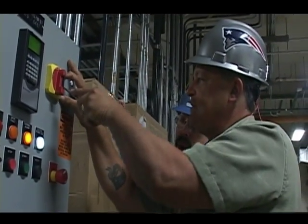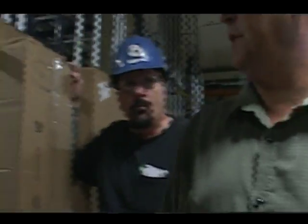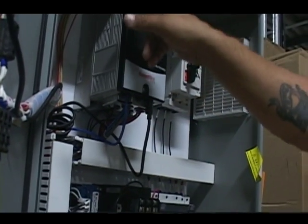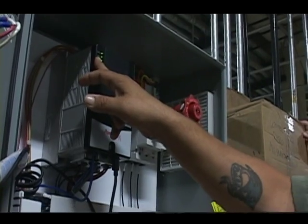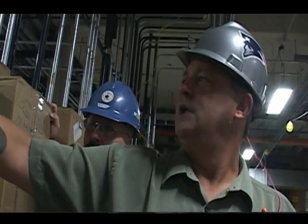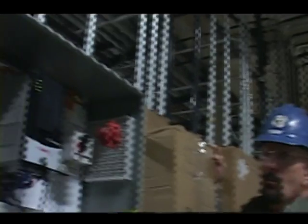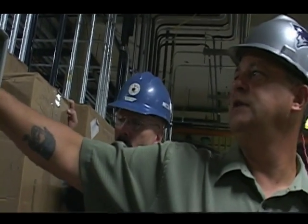Now, just so you know, the SCADA system happens to be on Ethernet, which is this piece of blue cable here. It's actually coming into a board that's mounted inside here, and these are the indicator lights of the health of that Ethernet network. This would be the normal condition: 3 solid green lights, one flashing green light.